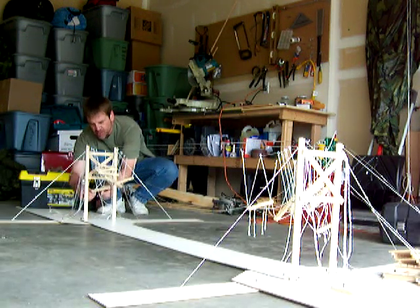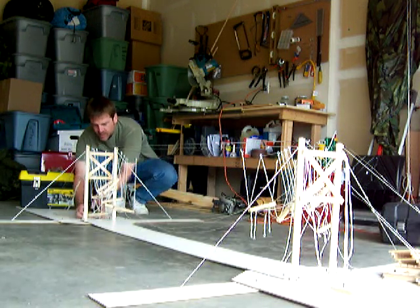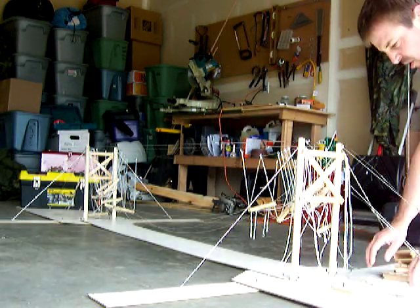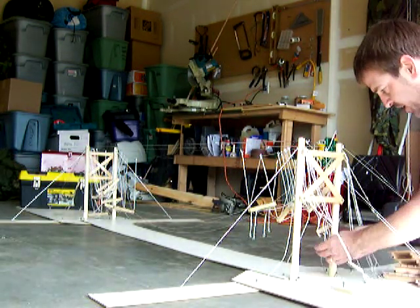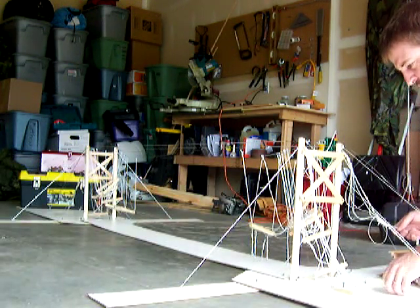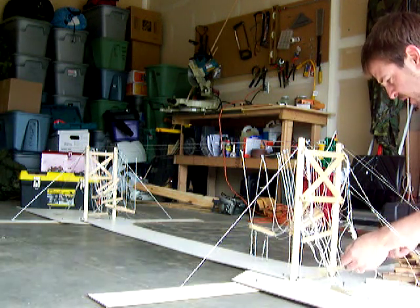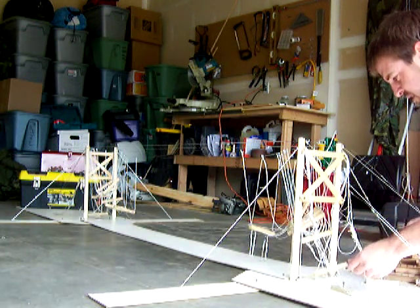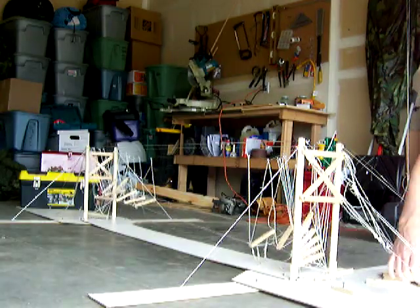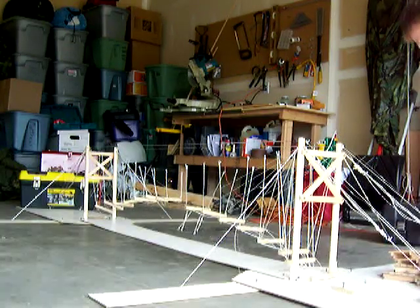These sections are pulled down — they are very lightweight — and connected. These will form the tension for the bottom arch. At this point, cables on this shore can be attached, probably just to a vehicle and a ball hitch, and pulled away from the shore. This brings together the two sections of the bridge.